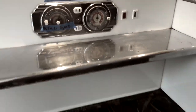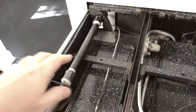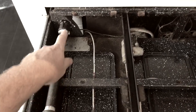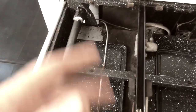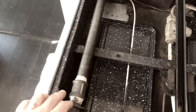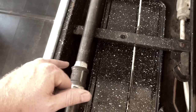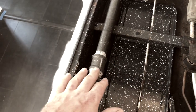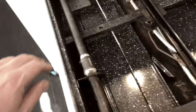The way this oven works is actually very simple. There's a main gas line here which I've had to replace because the old thread sizes to fit into the wall or the main gas feed were no longer compatible with today's sizes. I had to use my grinder to cut out a couple of things, but this is just a three-quarter inch black pipe you can get at Home Depot. Tighten it up using a wrench and some pipe dope. I like to tighten until you can see about three or four threads, but tighten it pretty firmly — you can over-tighten, so be careful.